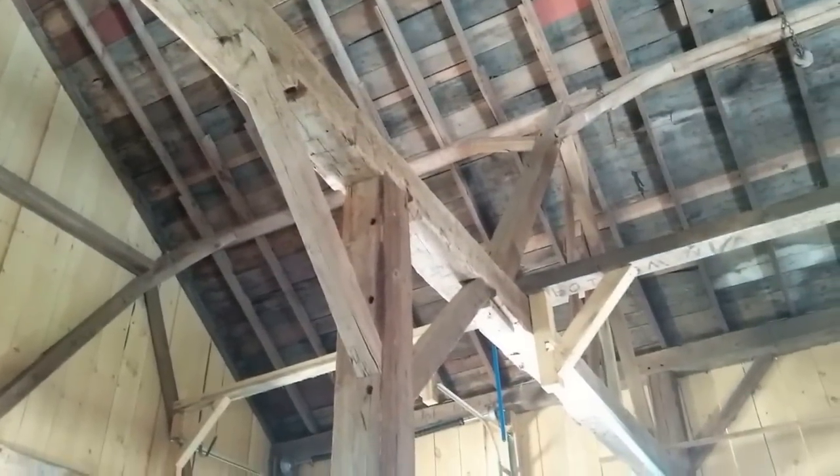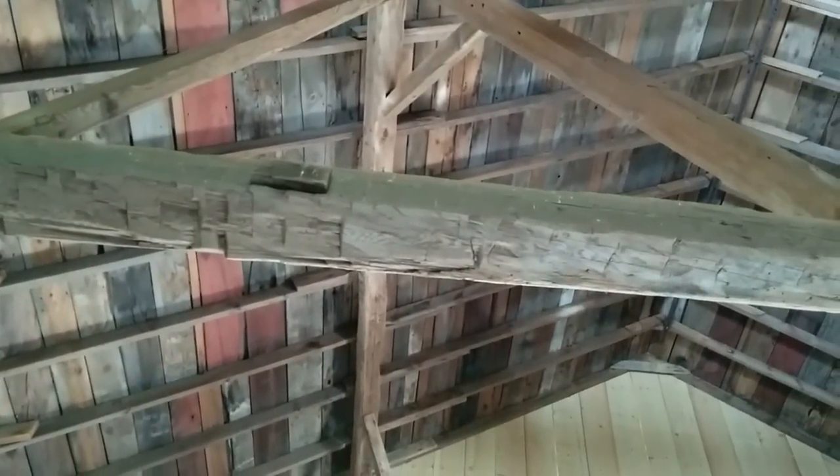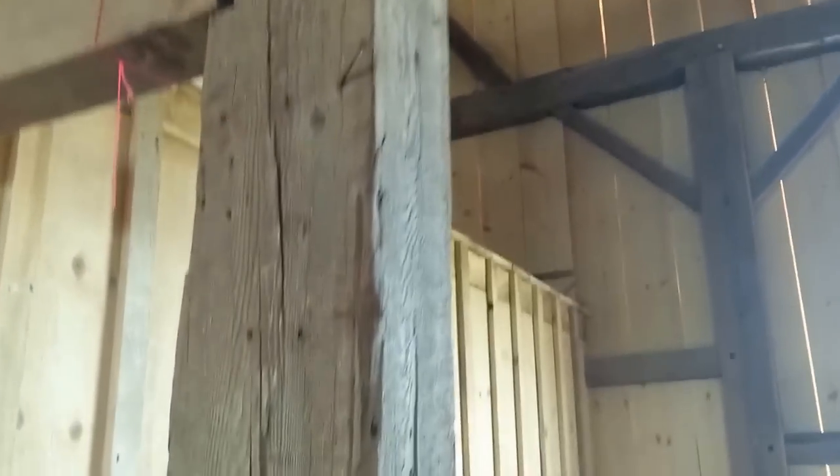He still has the old roofing material. You can see he's got some hand-hewn beams in here. I would date this barn because it's got longer beams — these beams are about 30 feet long from one side to the other — and those are hand-hewn, so they're made with an axe. Then the posts here are rough-sawn, so they're sawn with a sawmill. You can see if you look closely, they're sawn with a circle saw sawmill. You can see the fine detail of the saw marks — so it's a fairly large circular sawmill that sawed these beams.